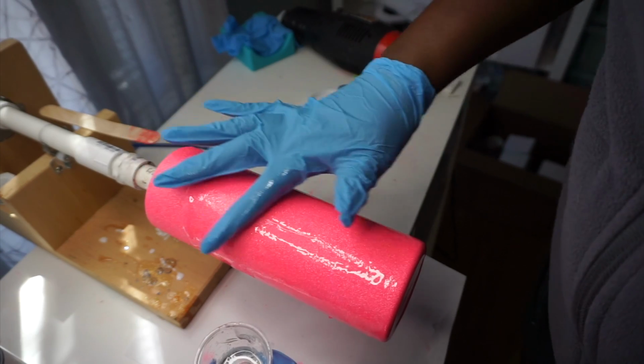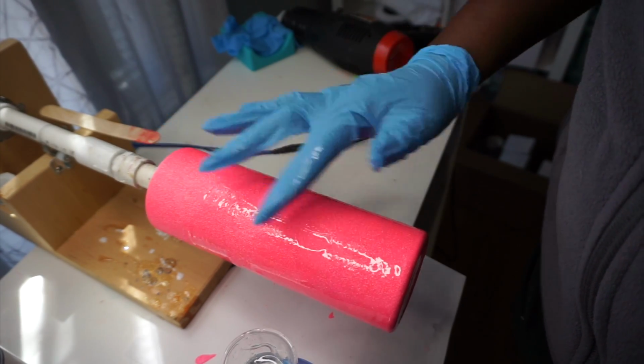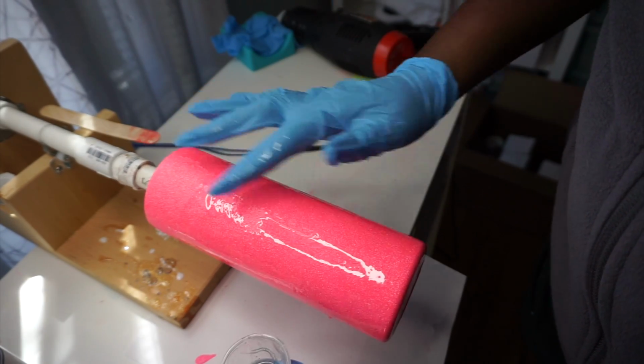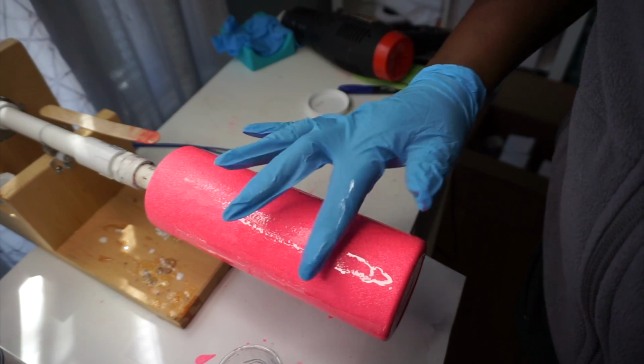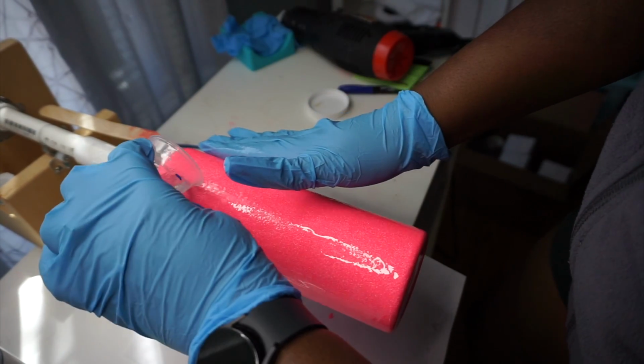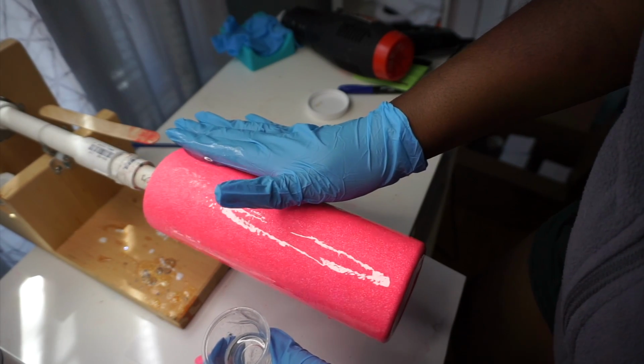and letting it smooth out on its own. Epoxy is a self-leveling material, which means that even if you don't get it on, like, don't trip because you feel like it doesn't look even. It's gonna self-level itself out. You got to get it on there. You got to make sure you have good coverage. You need to make sure you have 100% coverage.